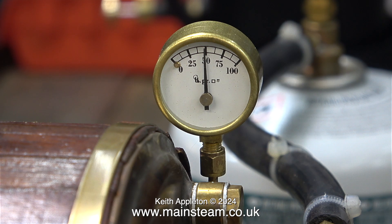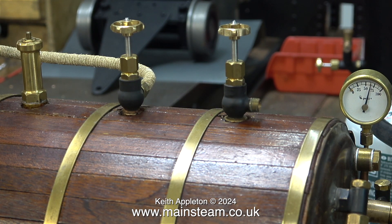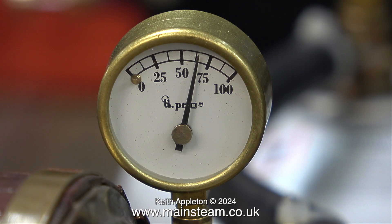These simple indicators tell me there is quite a good heat source keeping the water hot. In no time at all the boiler reaches its working pressure of sixty pounds per square inch and the safety valve starts to blow off. This is a pop safety valve but it's not exactly popping — it's doing a really good impression of severe flatulence, but it's not making a noise all the time like Stuart safety valves do. As I open the steam valve the pressure drops, then I close it and it rebuilds very quickly.